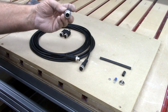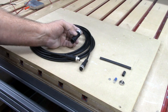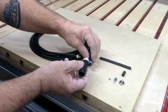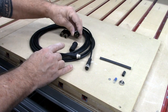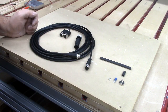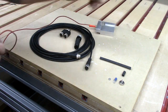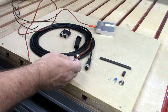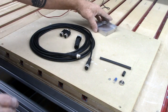For the far end I need a field wireable connection. This is just for convenience but it makes things much easier. This is simply a connector for the female end of this M12 cable, and I can take the shield off and wire my touch plate to it. It also comes with built-in strain relief which will be a lot more effective when I put some heat shrink tubing around it. The touch plate comes with a banana plug at one end, and I've got about three feet of 16 gauge wire here, and another three foot length of 16 gauge ground wire.